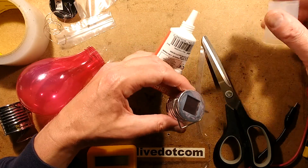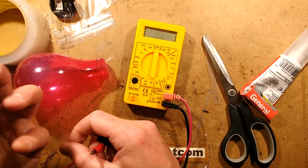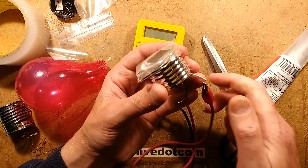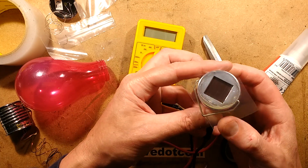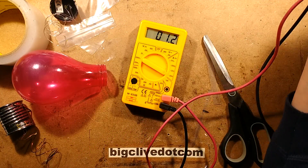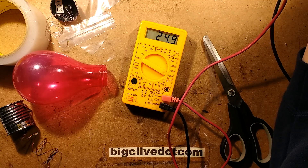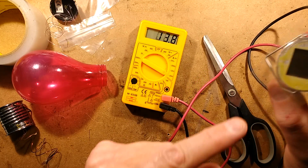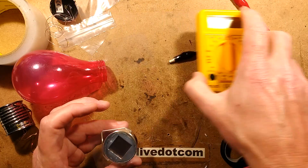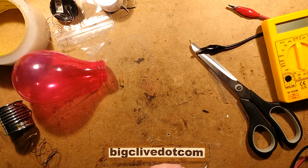The first thing I want to do is actually test this again and see if it's still performing as well. So let's bring the meter back in and see if the silicon is actually cutting down the light. The voltage will be the same, because the voltage tends to be the number of cells roughly multiplied by 0.5 to 0.6. So let's turn this up to the 200 milliamp setting. I got 25 last time — and I'm getting the same current. So the silicon is letting the light through absolutely perfectly. It's still putting out 25 milliamps in that tiny cell — I just can't get over that. I didn't really expect it to be so high, I thought it was just going to be a few milliamps.